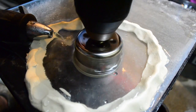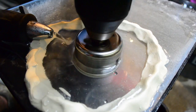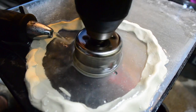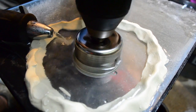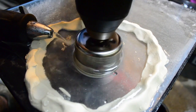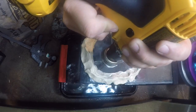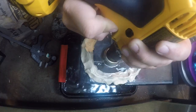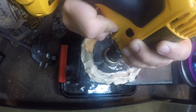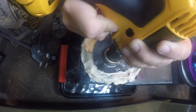It took me about 5 minutes actually to get through the glass and break it, and that was just way too fast. So I ended up slowing it down. I found that the average time per drill was about 20 minutes per 10-gallon aquarium, and the glass is really thin on a 10-gallon. I'm not sure if you have to use more caution working with thinner glass, or if it's the same no matter what, I don't know. But eventually I'll probably end up drilling aquariums that are bigger, and I'll find out then.